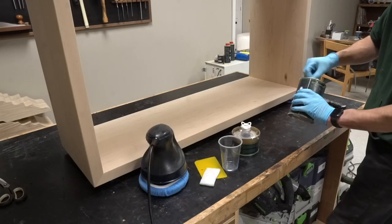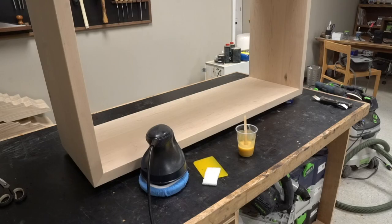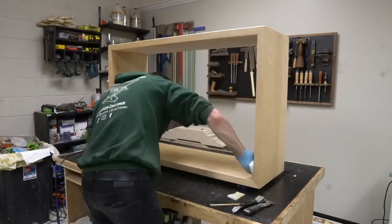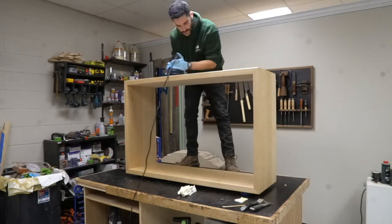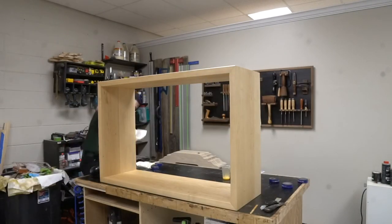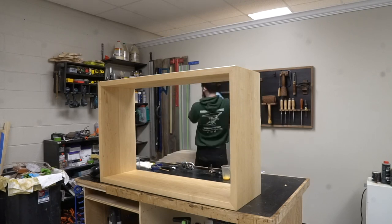After my final sanding, I mix up my favorite product — Rubio Monocoat. This stuff works great; it's super easy to apply, it's hard to mess up, it looks nice, and it smells pretty good too. I highly recommend it. You literally wipe it on, let it sit, buff it, then wipe it off and it looks incredible. I use a white Scotch-Brite pad for the corners and a squeegee to spread it on the large surfaces. If you've got extra leftover, just apply it to freshen up some of the stuff in your shop, like on your tool wall — you don't want to let that sweet stuff go to waste.